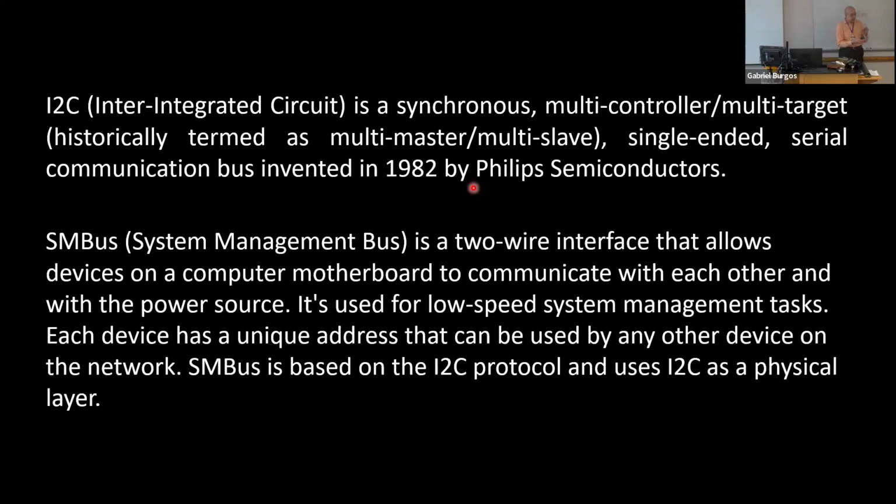You could solder 6 pins on here and then put jumper wires, plug it into a breadboard, and then jumper it. I've soldered wires right to those pads, and then you'll see that we're going to put it on top of our general purpose I/O connector. So a little background here.